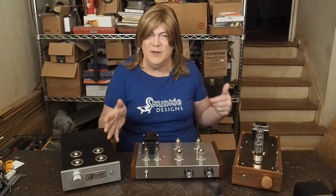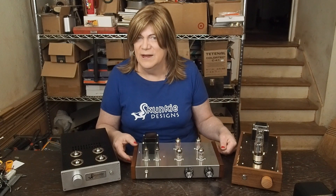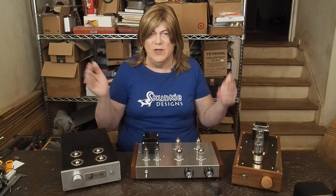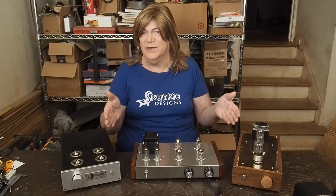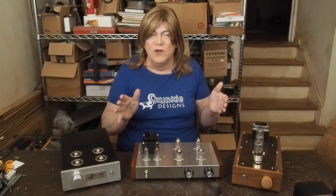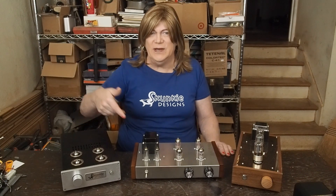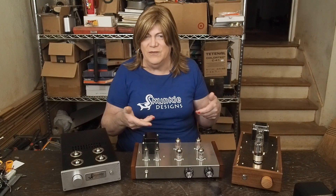I've got the parts on the way — not really expensive. I found these musical power supply output transformers on eBay, 30 bucks each for 10 watt, and they have a 5 or 7k tap primary, so they'll work perfect for these tubes. They don't have an ultralinear tap, but this amp is going to be the first one I've built as a straight-up Pentode amp, so that'll be fun. It's got a really unique feedback that comes off of the speaker jacks — kind of like global feedback, but because there's no driver tube, it goes into the cathode of the output tube.